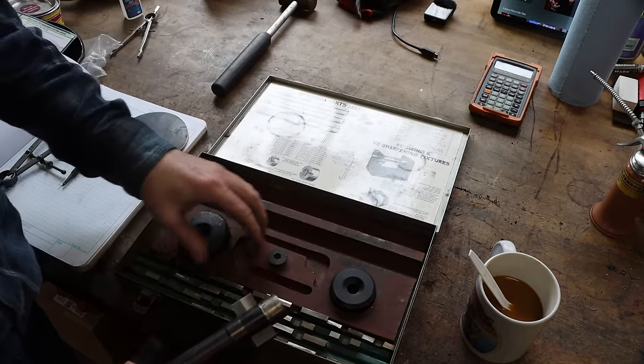now that we are almost done, all that is left is to weld our slug that I just turned down on the lathe. I need to weld it to the small flange that we made. So now we need to squeeze down and get up under this thing, get it good and centered, put a good spot weld on it, and then I'll take it off, take it to the bench, clamp it together real good, and weld the daylights out of that hole so it becomes one piece, basically. And then this part of the project is complete.